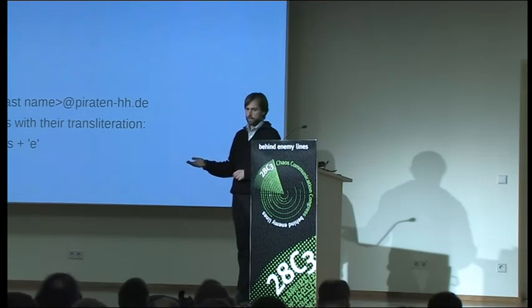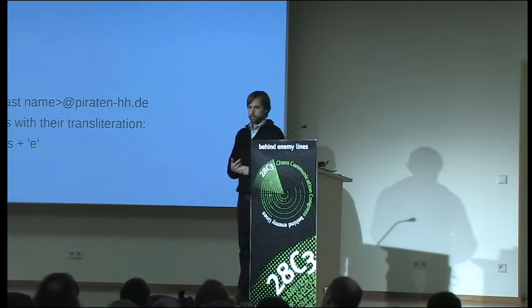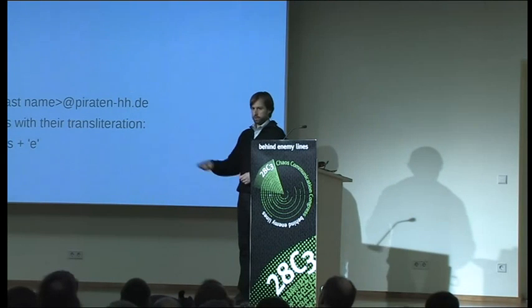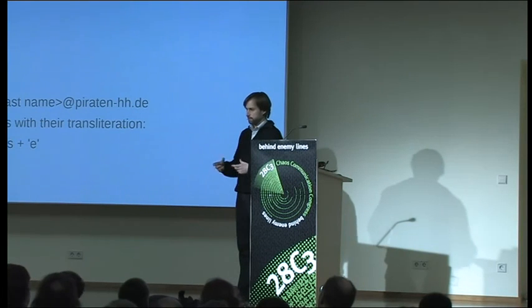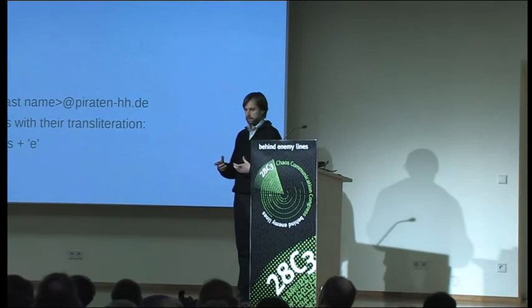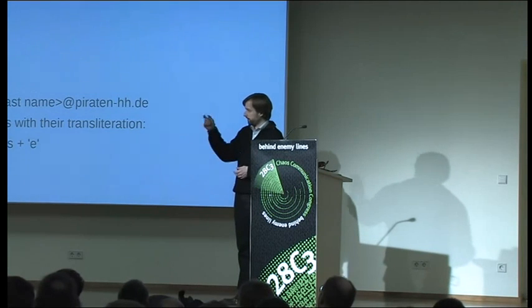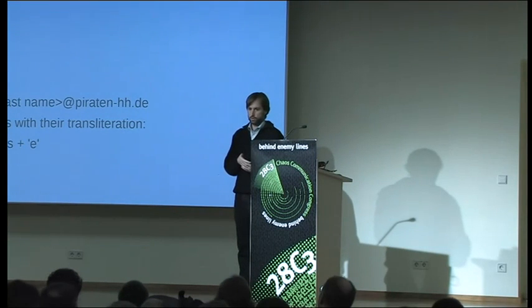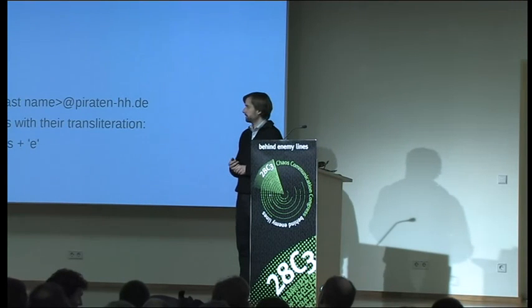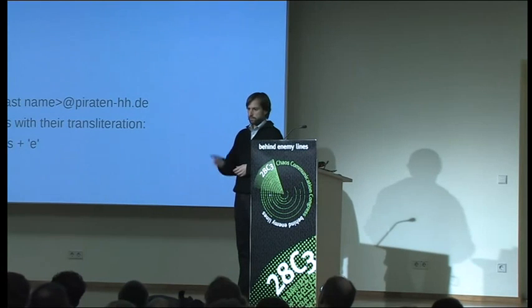There were gadgets like this. I had some bought on eBay from German companies. They don't produce it anymore. So I bought these from China, plug it into the wall, and they work. So the thing is, you have the grid tie inverter. It's the same thing like you have in your car. You plug in 12 volts that come out of your car, or you take the 12 volts that come out of this photovoltaic thing, and it changes this to 230 volts AC power, and then you have to have the synchronization and the mechanism that cuts it off the net so that you don't get electrocuted. And that's basically it.